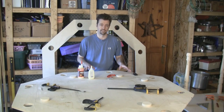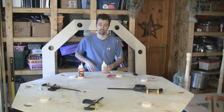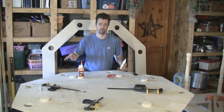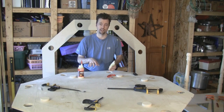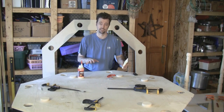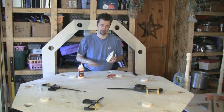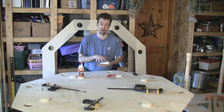When you're ready to glue the two pieces together, run a bead of carpenter's glue along the inside edge and the outside edge and then put a zigzag in between. Have all your clamps ready to go before you start with the glue — that way there's a minimum amount of time between putting the glue down and starting the clamp. You don't want to give this any time to form a skin over top of the glue, otherwise the wood won't bond.